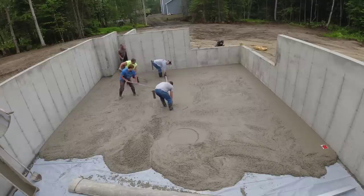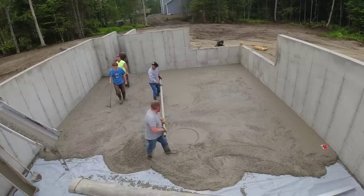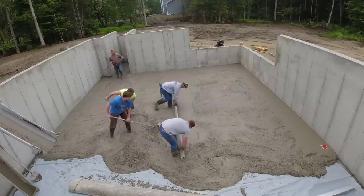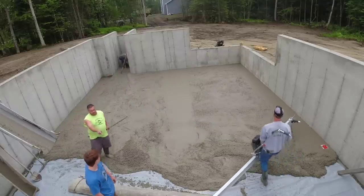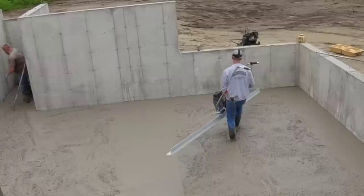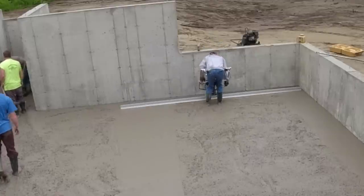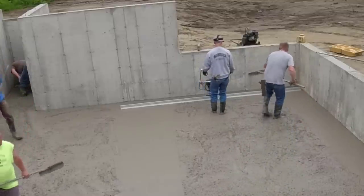On the outside edges we've got a blue chalk line snapped around there that we shot using the laser level. A lot of times we'll do that in advance, like the day before or the week before, to check the grade and figure the right amount of concrete. We're getting that center pad screeded — we call that a wet pad — and we're going to screed right off these wet pads. Tomahawk has all kinds of different lengths of boards from four feet to 14 feet in two-foot increments. They're made out of magnesium so they're fairly lightweight. My first initial thought when I picked this thing up was: this thing is rugged — it's built really, really well.